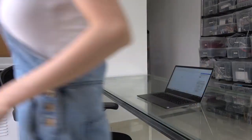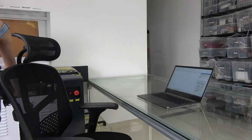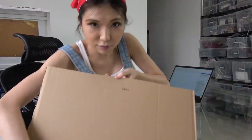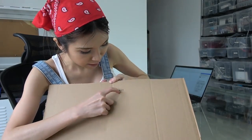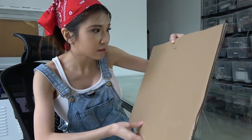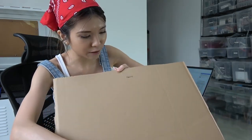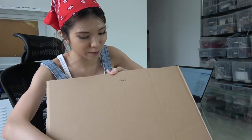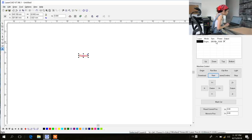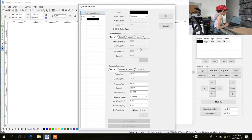Let's take a look. I don't know if you can see it — it's cut through, but I think I can turn up the power a little bit. So I am going to change the settings: I'll change it to 15% and the speed maybe a little bit faster, 300, and then click OK.